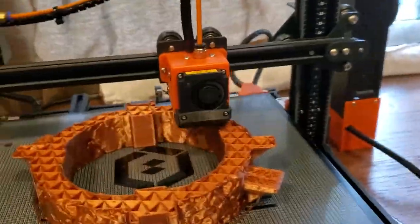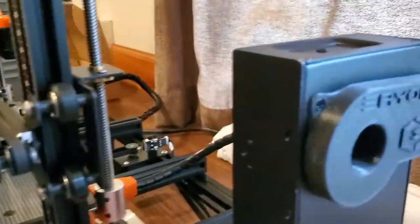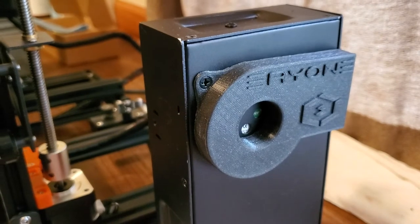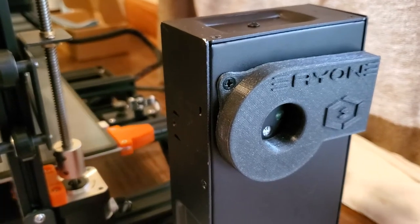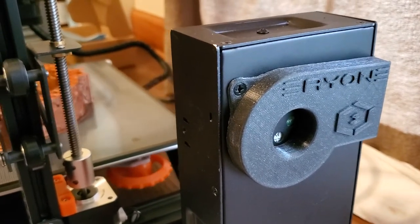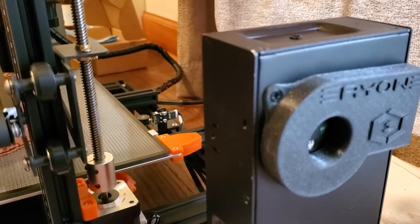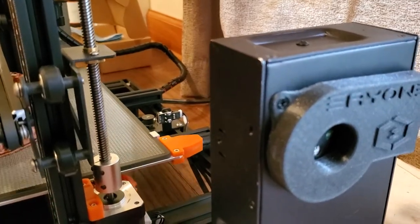Last but not least — probably the least quote functional, but it does cut down on noise a bit — is I printed a fan duct or fan shroud for the power supply. It looks really nice, it has the Aerie1 logo, and it's done by somebody on Thingiverse. Again, you'll be able to find that link on the Facebook group's spreadsheet. This actually directs the fan exhaust aft, as well as lowers by several dB the noise of the power supply fan. As you can tell overall, this is a very quiet printer, and this just makes it even more quiet.